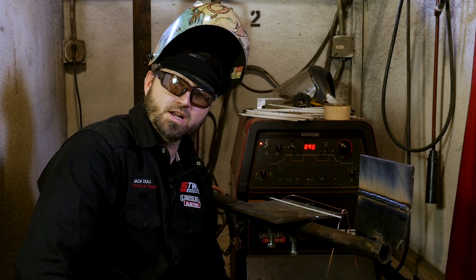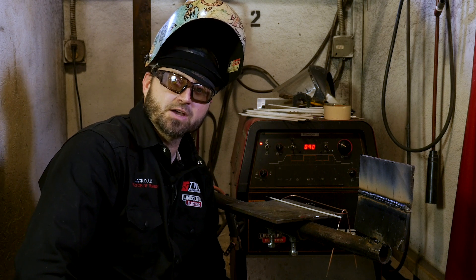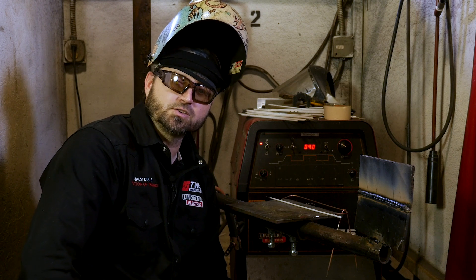Like I say — 1/8th land, 1/8th gap. I hope you enjoyed our video. Looking forward to hearing back from you. If you've got questions or concerns, please reach out to Tulsa Welding School — we'll be glad to answer your questions. Thank you.